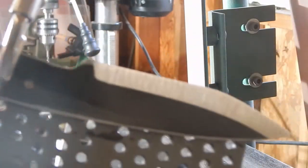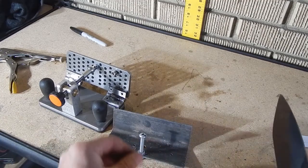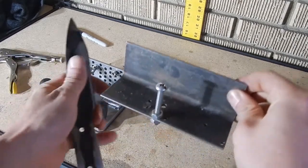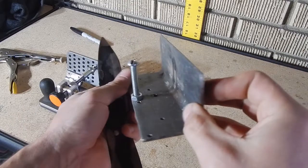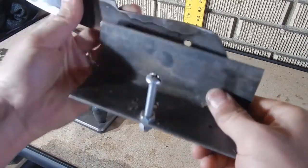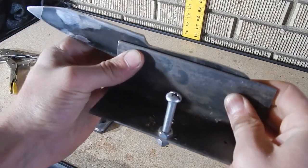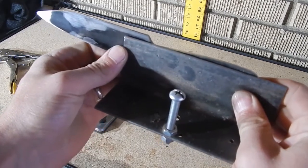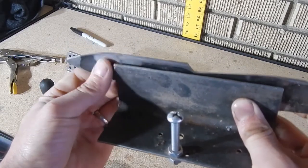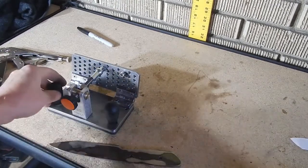Just a few passes and you can see it's already looking really good. This is the jig that I made — I wanted something cheap and quick to make, and it worked for a little while, but the grind lines I got from it weren't straight or even. It was really hard to apply equal pressure; I was better at grinding one side than the other. With the OZO tool grinder, because of the two handles, it makes grinding both sides real easy. Most people will apply more pressure on one side, so it really helps out.